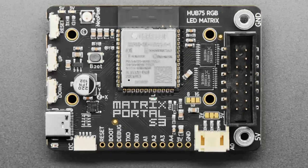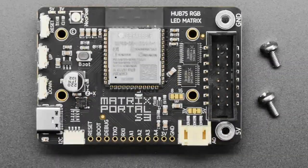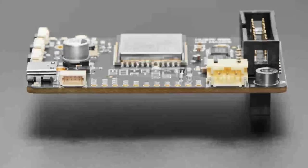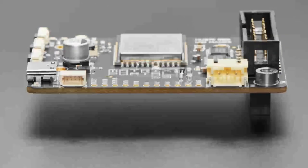The Matrix Portal S3 has native Wi-Fi and BLE. It's the same physical size, has the same GPIO at the bottom, and the same pinout for the LED matrix. One improvement is you can now plug it onto the back of the matrix on the bottom - it sockets right in - or matrices that come with a cable, you can plug the cable into the top. It has some mounting holes and a bit more flexibility. It should be completely code compatible in CircuitPython and Arduino. Maker Melissa went through all of our guides that use the Matrix Portal and made sure they all worked on the Matrix Portal S3 - only one guide needed a little bit of hardware adjustment.